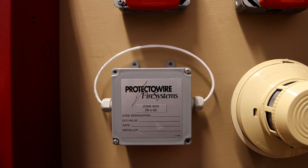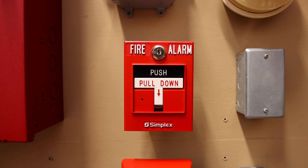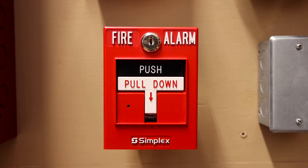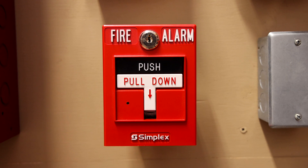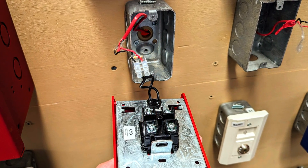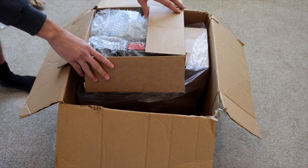Since we have a Simplex Fire Alarm on the board, I figured we'd keep with the theme a little bit. As a pull station, I installed my new Simplex 4099-9006 Addressable Dual Action Fire Alarm Pull Station. This pull station is addressable and it's being used on a conventional fire alarm system. In order to bypass the addressable module, you just wire everything straight into the button on the back and not use the terminals at all. This is the pull station that I unboxed a couple videos back that an awesome subscriber — or a small group of people — sent in.